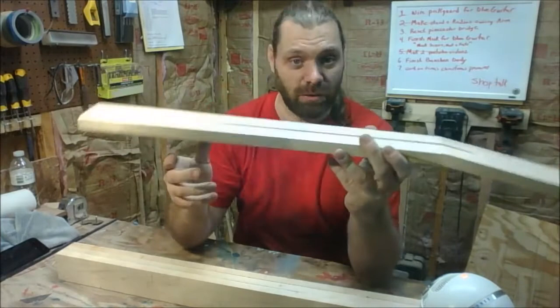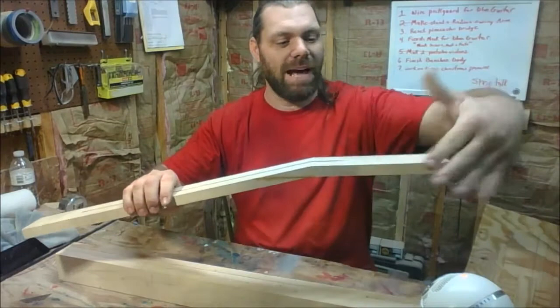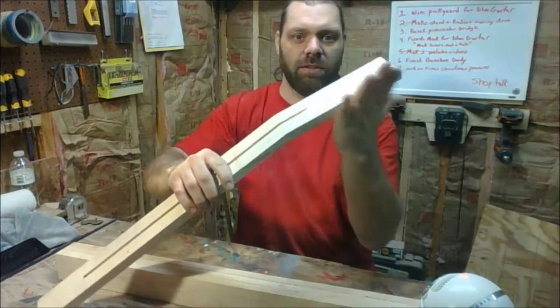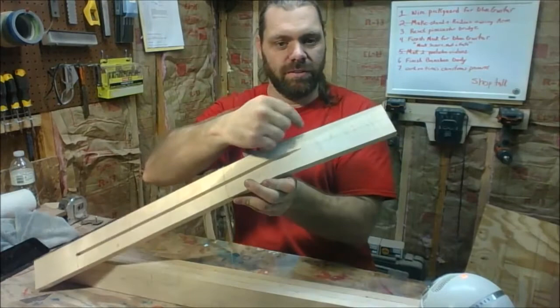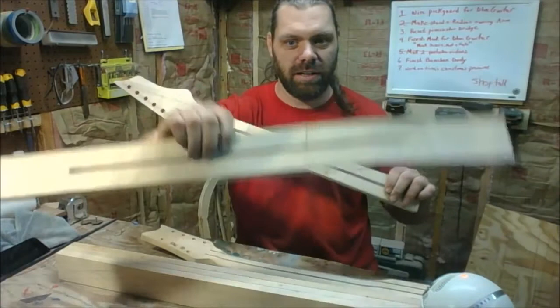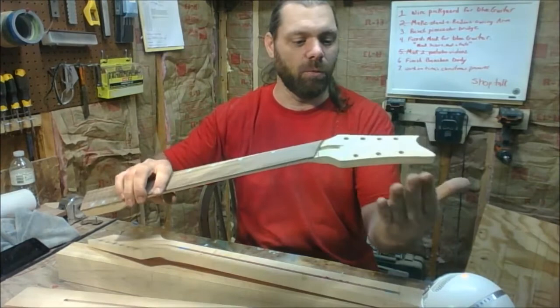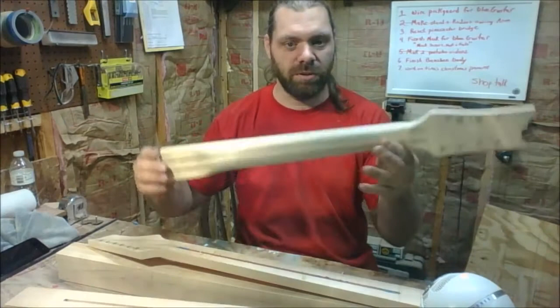That's what I got on that Flying V neck — it's like this. This is the one-piece concept, but three pieces get the same offset. I took a piece of maple and glued it as a wing on, extending it three or four inches, so I could draw my offset coming out, across, and back down. From there it's straightforward: route a truss rod channel, install a truss rod, glue on a fretboard. This is the five-piece neck with two stripes of walnut, showing what that looks like.